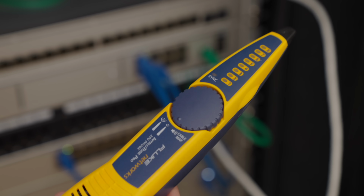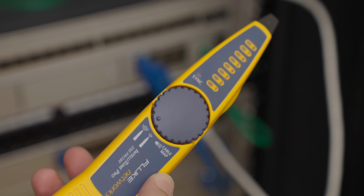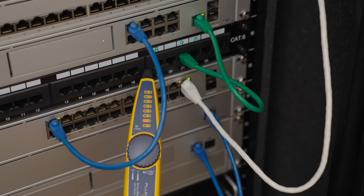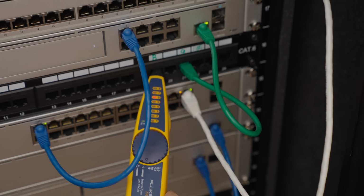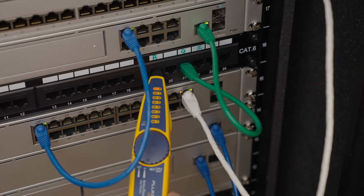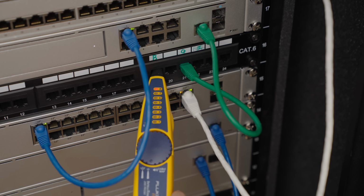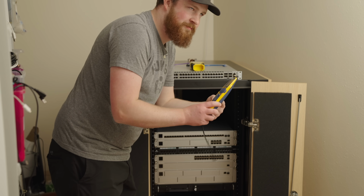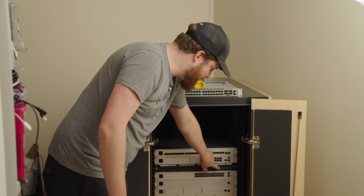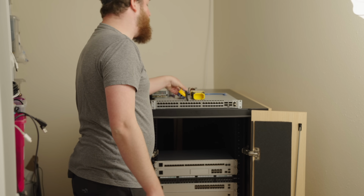This first one is one that you probably won't need because it's for fancy pants, but it's called a toner. If you've got a lot of cables that you have installed in your house, it's really good at helping you find something quickly. So I've got a repeater plugged into one cable somewhere in my office, but I don't know which one it is. So I can just take this wand and rub it in front, and as soon as it starts to make a noise, I can get into the precision mode, and then I actually put it inside each slot. So that's a number 2, but if I put it here, that's a number 7. The stronger the signal, the more confident it is that this is the cable you want to talk to. So this cable that's plugged in on the other end is number 20 right here. That's pretty cool. But you probably don't need a toner.